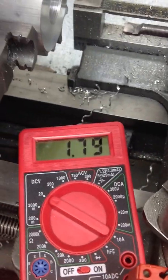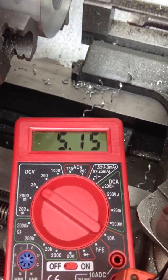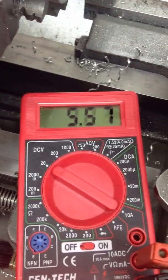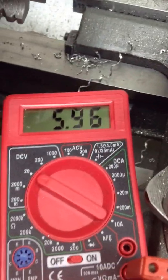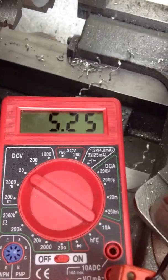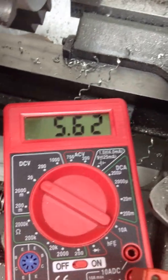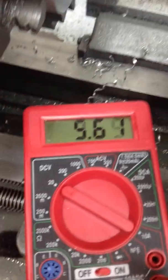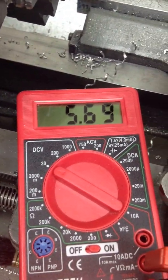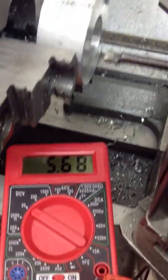The other thing that people wonder about is what's the resistance as I move the bearing, and you can see it's quite volatile. It'll dip down to less than an ohm, and in this particular case it's bouncing back up to above the threshold for the Model 100, so most of the time I don't have a problem. But there are some times when I have to give it a little bump to get it above the 2.06 ohm threshold.